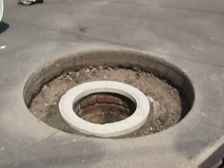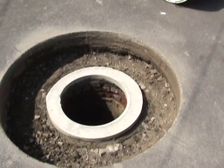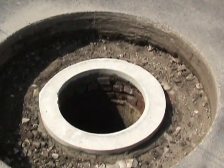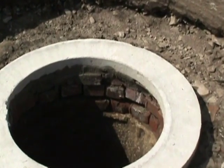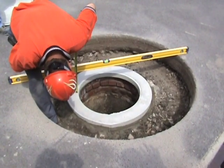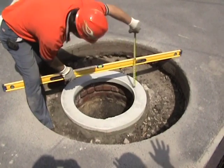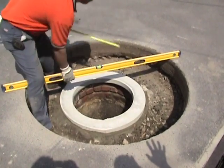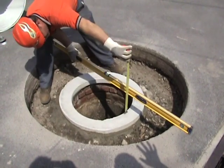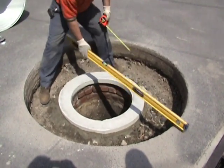You've got a measurement — for example, nine and three-eighths inches. Determine the height of the casting, subtract that from the nine and three-eighths, and that gives you the liner length. Consider the casting type: if it has a ridge or flange coming down from the main flange, make sure it won't interfere with the liner placement. Test a piece of 27-inch liner to see if it hits that flange; if it does, try a 30-inch liner. Measure the frame from top to bottom without including the flange. Use the caliper included in your package — go inside the frame from top to bottom, tighten, set it, and transfer that measurement to the Easy Slope marker.